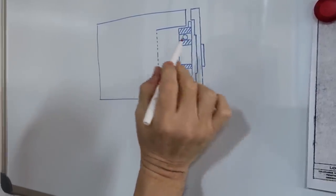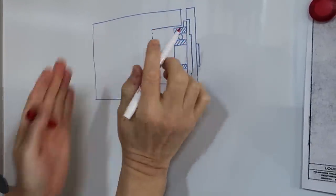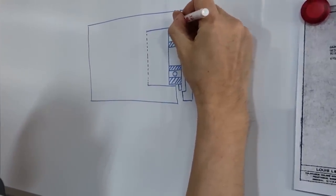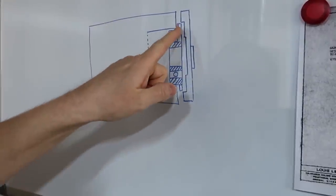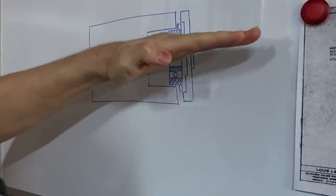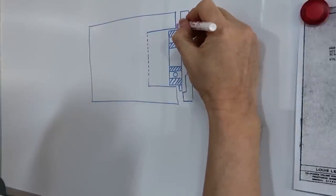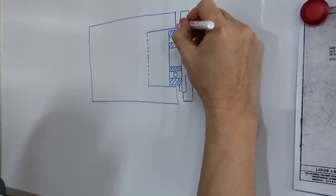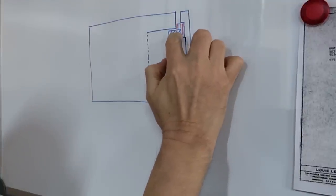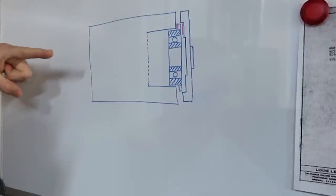So let's look at the contact points on the bearing that's holding this assembly in place. On the left side of the flange, we've got this contact area in red. That flange is sitting on the headstock front, so it's holding the spindle from falling through to the left. Yeah, I can see that's going to hold up. And then on the right side of the flange, and on the outside bearing race, we've got that contact area resting on the bearing cap. So it's holding in that bearing so the spindle won't go the other way. Oh, I see.